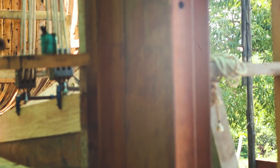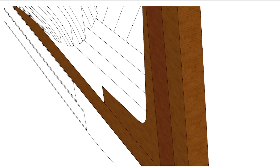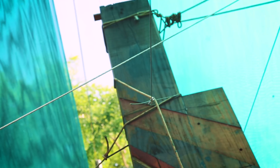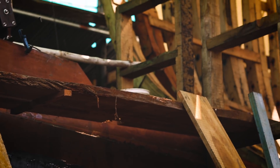The stern post is the aftmost structural piece of the boat that the rudder hangs off of. The post itself is made of two pieces: the stern post and the rudder post, the rudder post being the one at the very aft end. The stern post is the taller of the two, and there's a knee just in front of that. They're the main part of the whole stern assembly and they're made of two massive guapinol timbers — really, really heavy, like two together are about 1,500 kilos.